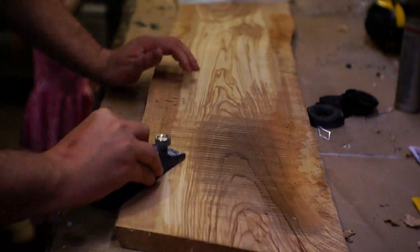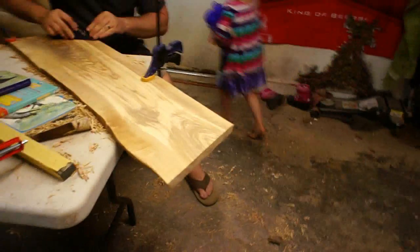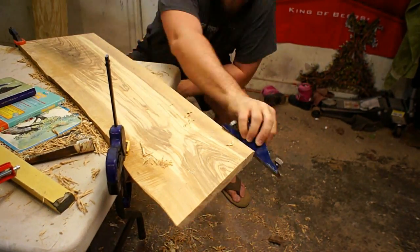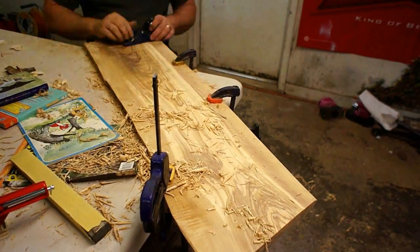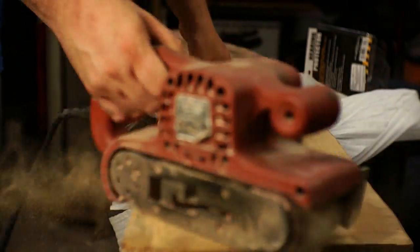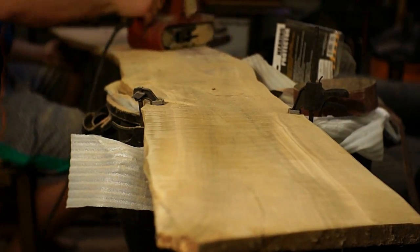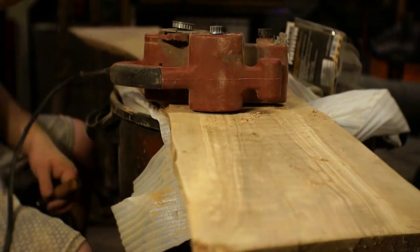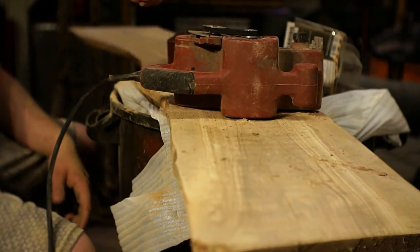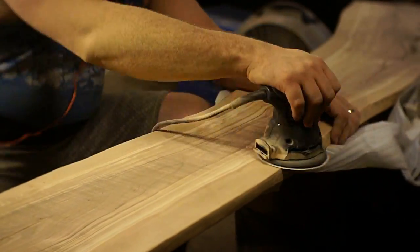With this shot you can really see how unfinished the wood was — this is just chatter from when they put it through the planer; it didn't get all the way down through it. So I started out with a hand plane, though I probably should have bought a different block plane. After way too long with the hand planer I switched to the belt sander to see if that would be any quicker. I got through a couple of belts and then all of a sudden it started making a funny noise. I think the dust outlet port got blocked and it overheated — it melted something inside and the pulley went off kilter and just wouldn't stay right. On the third method, I at least finished up the last board with the random orbital sander, then decided that was taking too long and went out to buy another belt sander.